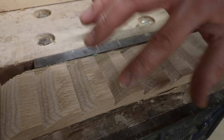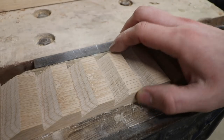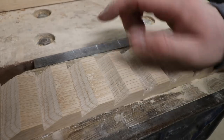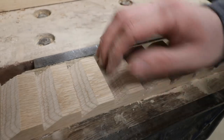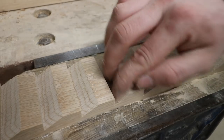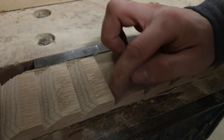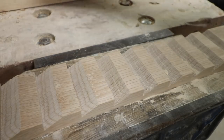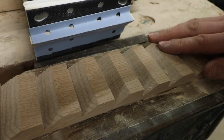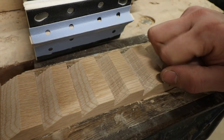There's not any rounding of the cut or anything, because the sander's action is really flat across the timber, so there's not too much rounding on the corners. And it's done a perfect job of sanding that back, and it's sanded this section in here right into the point, so there's no way you're going to feel any roughness in the corner of that cut out with your hands, because this is getting a lot deeper than your finger can reach within that piece. So it's doing a really good job. That's the 120 grit, and I'll now move up to a 240 and then a 320.